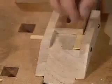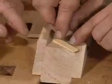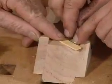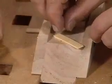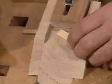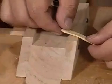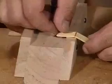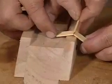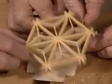I would turn it around, and then I take a special saw that has no set, so it's a very fine blade. Oh my gosh. And I kerf it almost all the way through, but not quite. I put a little bit of water on the back, and that allows you to make it flexible, to open it up. So that's what you're talking about with the hinge. Yeah. And then that goes in, and by pressure, keys the whole triangle together. I got you.